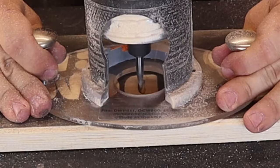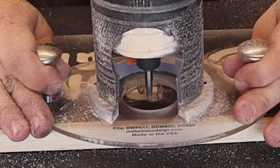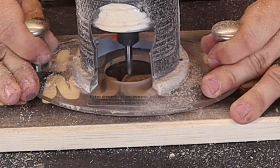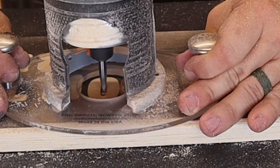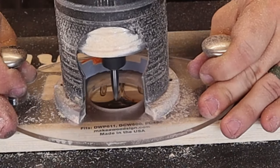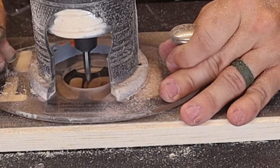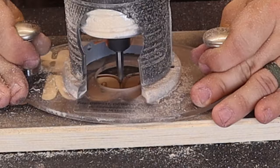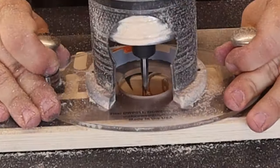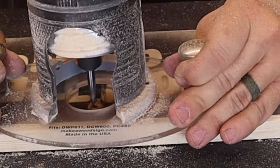Now I'm going to do my outset letters and I'm going to start off the same depth I did around the Grinch smile, which is 3/16ths of an inch deep. Now some people don't really like outset, but some people don't really like inset. Usually when I'm selling signs, unless it's a stock sign where I just make a bunch of them and people hand me money, if I'm doing something custom, I give them the option. There's not a whole lot of signs that you can do inset but can't do outset. It has more to do with the size of the board because you do need a little bit more room, but I think outset looks a lot better.